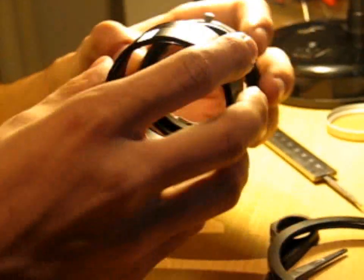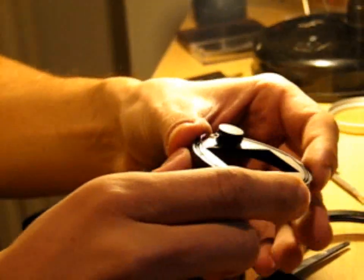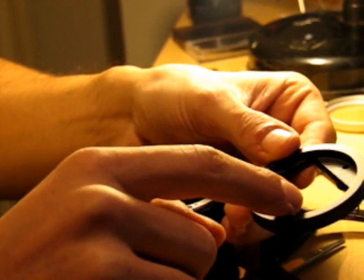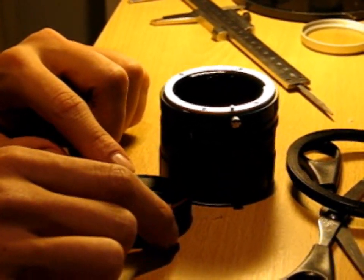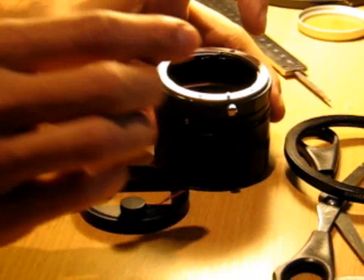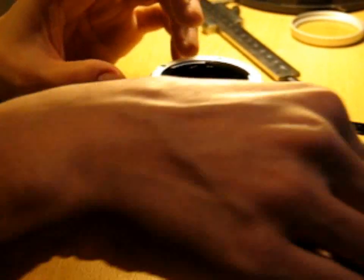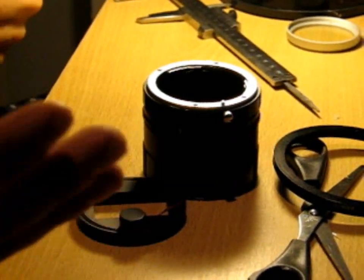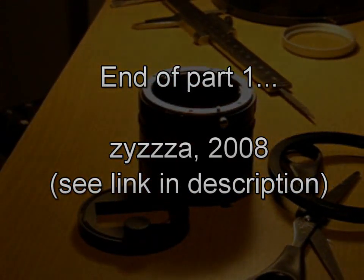Because we are using Nikon. The distance should be measured from the bayonet ring to the back side of the screen holder — I will show you now. That's the back side of the screen holder, and that's the front side where the screen will pop in. This distance is needed in order to properly focus the image. If you put it in the wrong place, you will not be able to focus at large distances — like unlimited distance or more than 10 to 20 meters — it will always be blurred. You need to focus to infinity.